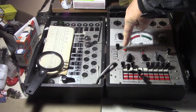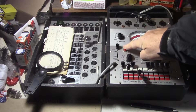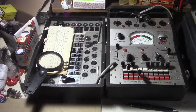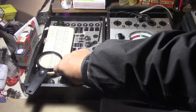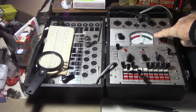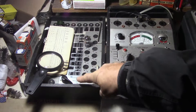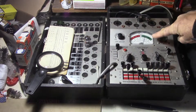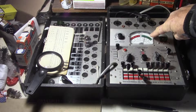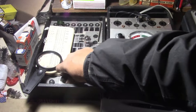First I'm going to press the line level so it gets calibrated. Now this is triode one and it tests at 90, which is really good — it's a good tube. And then on triode two, which is the down position, it also tests at 90. So this is a pretty balanced tube on this tester.